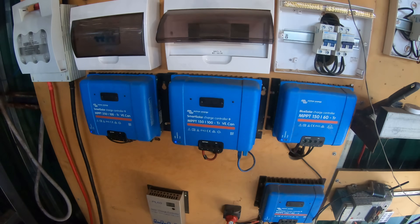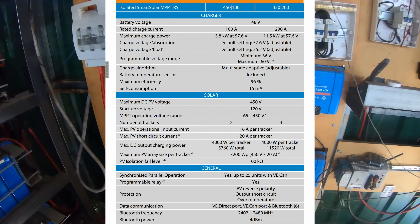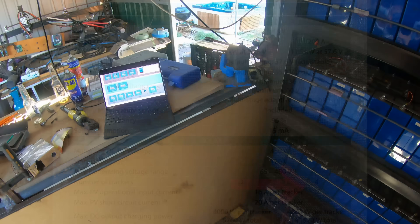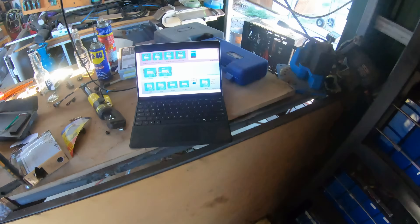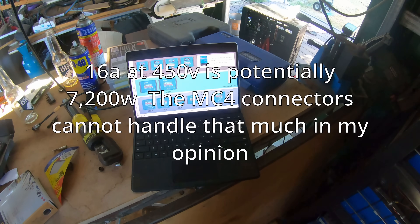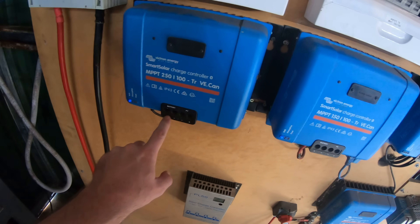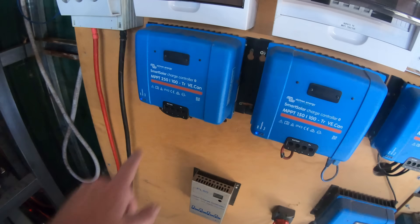The outlier is the 200-amp version, which has four MPPT trackers and is 11.7 kilowatts. But the MPPT trackers themselves can only track 16 amps of PV input, so you've got to be careful about the way that you configure it — there are some caveats there. For these standard units there is a short-circuit current limit you've got to be wary of as well.